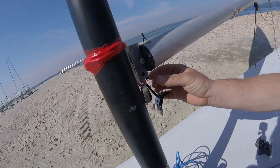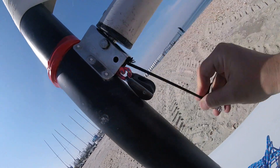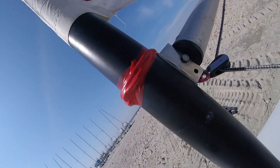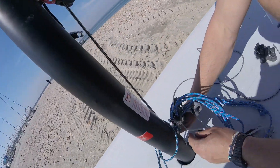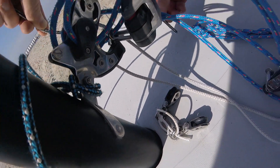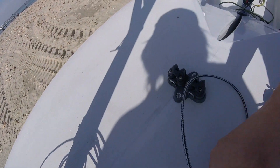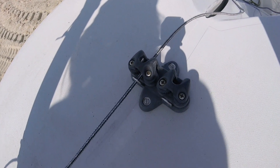At the gooseneck, take a quick look at what's going on underneath. We've got two different ropes: a pulley on a rope and a pulley on a bungee. We're going to go with the pulley on the rope first — the outhaul goes through there, and I'm keeping tension on it the whole time to stop the sail flapping. Make sure nothing else is in the way below. The rope comes down the right-hand side of the kicker so it won't get tangled, then through the block on the floor, and then through this cleat, which is nice and secure for the time being.